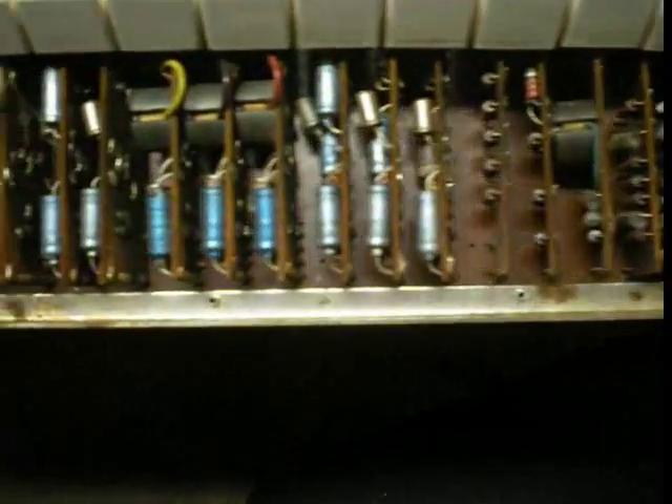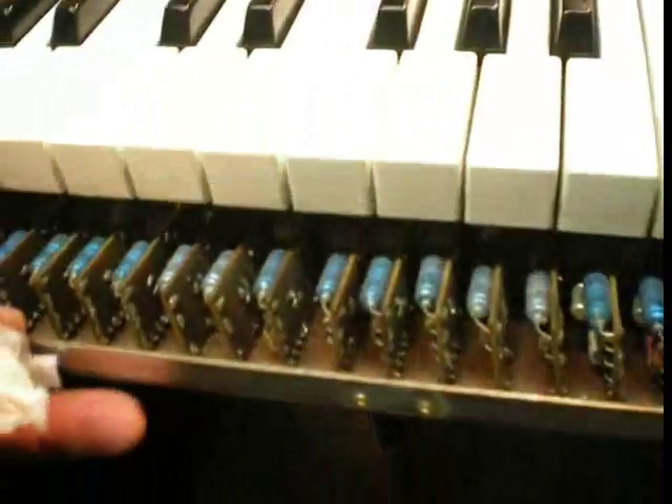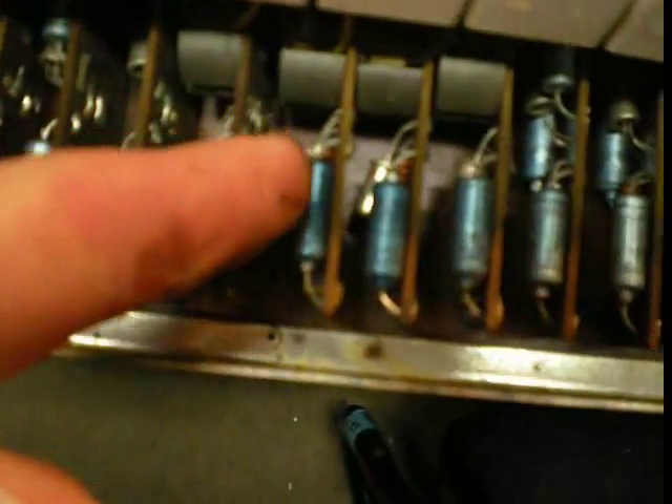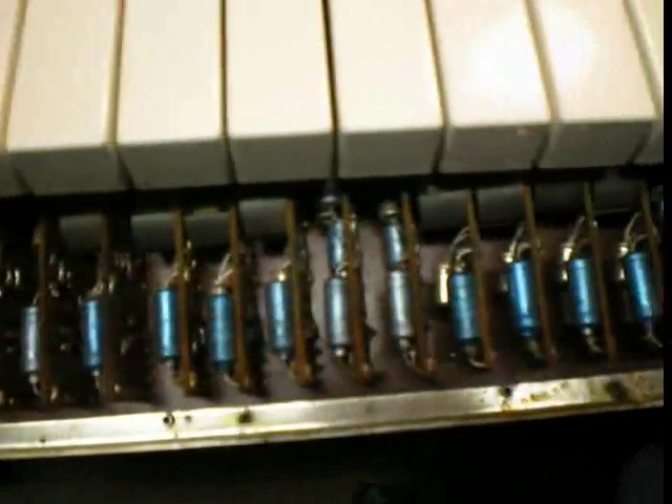Here is the under-key circuitry. Here's the keys. I pulled this tray out — you can see the tray just bolts right in on both ends. This other thing goes right in the front of it. All that circuitry is underneath; those are all filters. Each one has a transistor and a few capacitors — those are wave-shaping filters. Over here are the mixing pieces with resistor packs to distribute the footages.